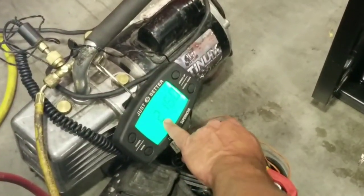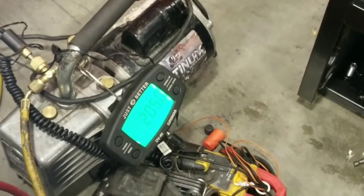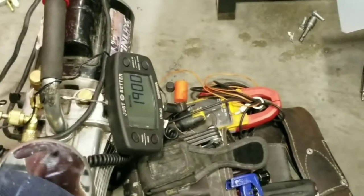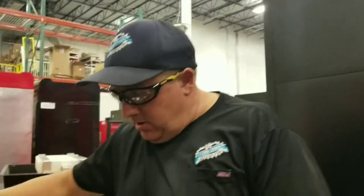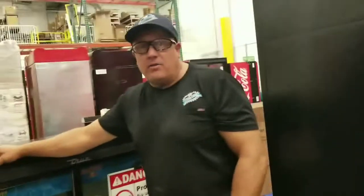And we're not going to put anything in here until we're about to do our 300 microns to 500 microns. And if we don't achieve 200 to 300 microns or 500 microns, then there's a leak in the system. That's why it's critical that that gauge is put on that system, so that we're not losing the freon into the air and causing problems.